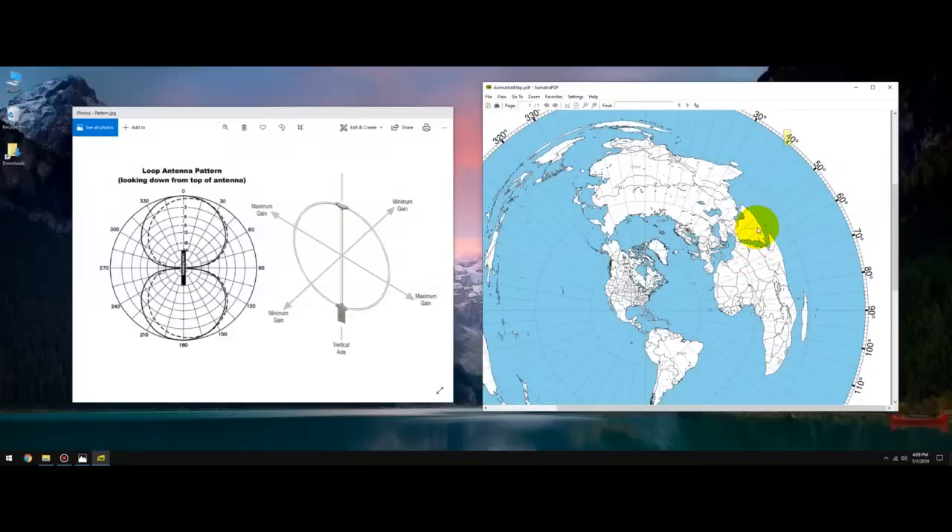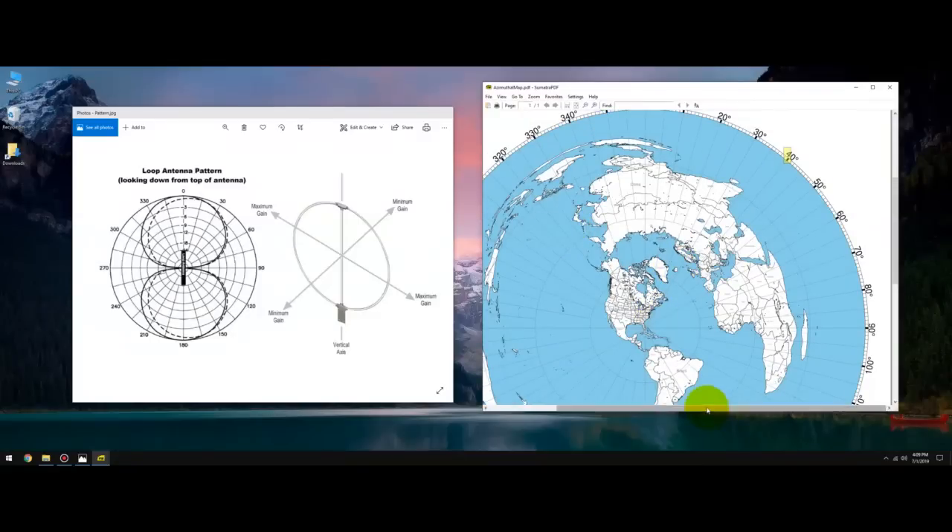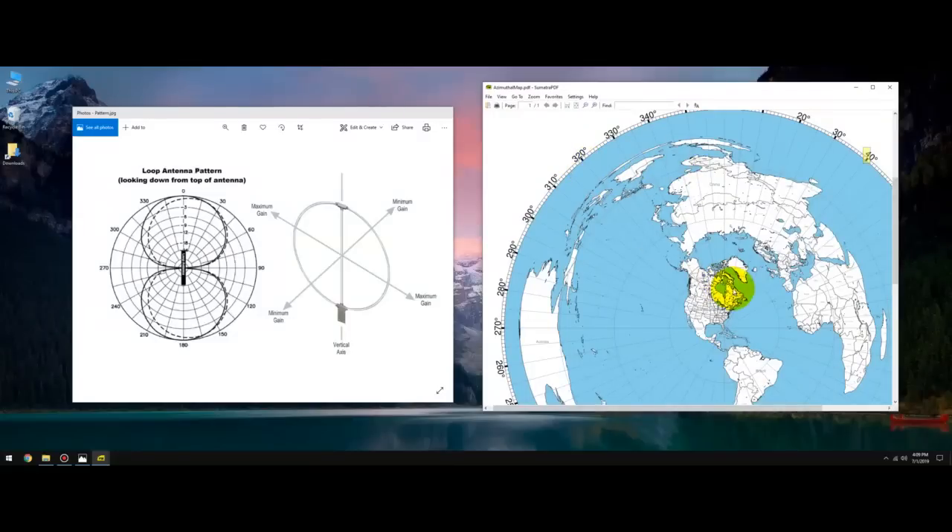Looking at the pattern, I figured my best bet is to point it 40 degrees northeast — most of the stations I want to listen to are transmitting from Europe. I'll still pick up Africa, South America, and similar through the plane of the loop. When I put the second loop up, the first stays at 40 degrees northeast and the second goes to 320 degrees northwest. I'll be running the RSP Duo in diversity mode using both tuners simultaneously, which in theory gives a better SNR — or I can use single tuner mode and pick whichever loop I want. I'll put links in the description and if you have questions leave them in the comments. 73.